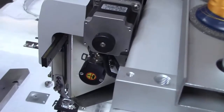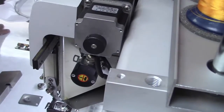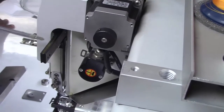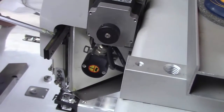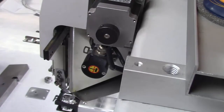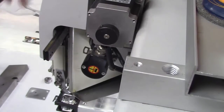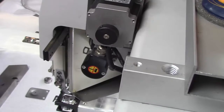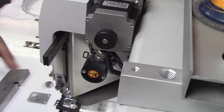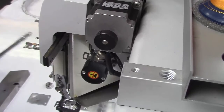The next lubrication point is going to be on this rail. If you see it dirty, you're going to wipe it off and put a slim layer of grease. To do the same process on the other side, you would hit needle 15 — it will change on you, you remove your cover, and you will find this same guide on the other side and grease that.